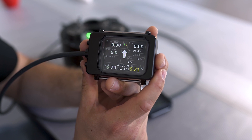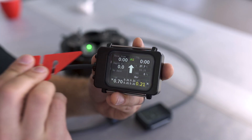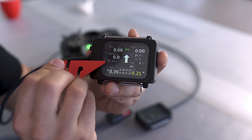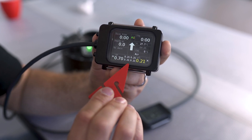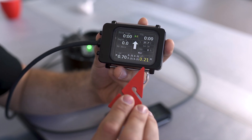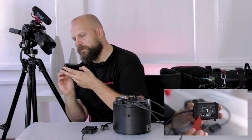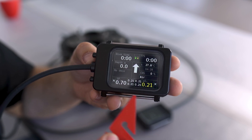Let's have a look at the screens in dive mode. This is our main detailed screen. Up in the top middle section you can see the status of both batteries. In the top left corner you have dive time, below that your depth, and below that your decompression information. In the central section you can see the partial pressure on each one of our oxygen cells. On the left of that we have our set point, and on the right you have the current partial pressure of oxygen — here on the table it reads 0.21. On the bottom corners you can see our solenoids working: now this solenoid is open, now it's closed, and now it's open again trying to bring the PO2 up to our set point.